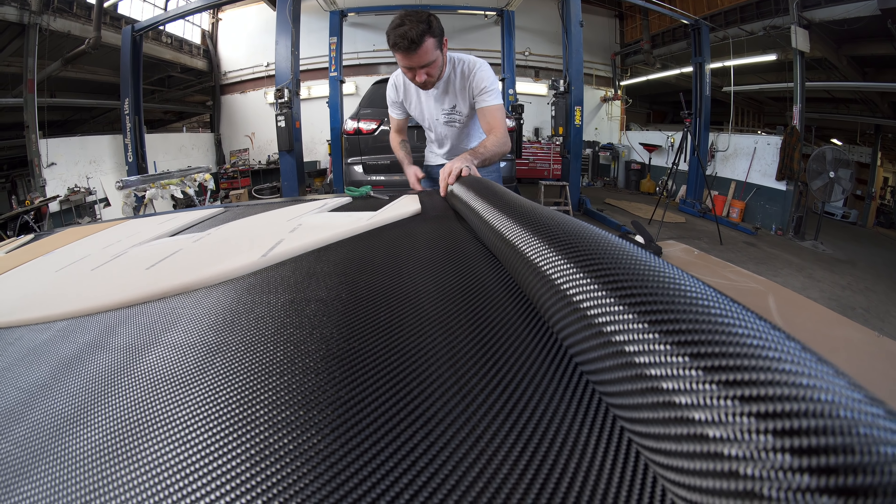We've definitely arrived at Tim's favorite part of the process. In this phase it's all about the preparation — make sure you have a good base plate. You always want to use this when you're doing infusions — it gives the resin somewhere to go, it clears the path for it. It gives a little bit of height on this versus the other stuff, where the resin can actually move through. I'm cutting slits in it to keep it from creating an air bubble so it can curve with all the other materials.